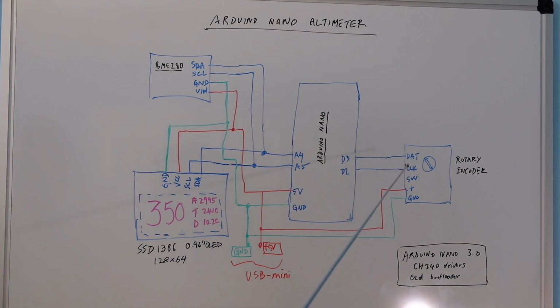So you can do that in a fixed location. But if you're flying along or you're traveling somewhere, you don't know what the altitude is, so you have to take the sea level altimeter setting, which is usually published in various websites, METAR reports and so on for pilots, and you can use that setting to basically get the true compensation you need to do for that particular air pressure that is at that location. So that's the background of the altimeter.